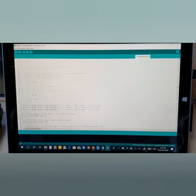Now you see your BLTouch is here. I explained in a previous video that the BLTouch will be over here. I already typed 0, which is here. If you want to move a little bit, it becomes 1, 2, 3, 4, so plus 1, plus 2, plus 3, plus 4. You need to put plus 1, 2, 3, 4. And if you go backward, it becomes minus 1, minus 2, minus 3, minus 4. Now you're in the middle, so you don't need to do anything. It's 0.